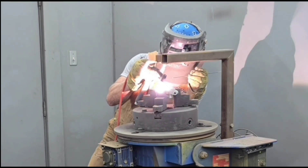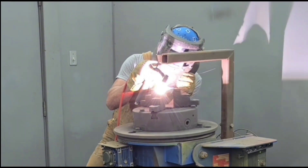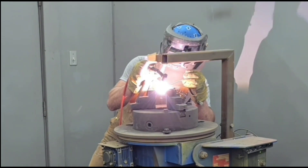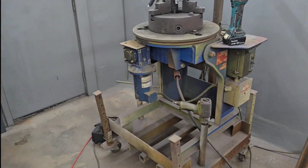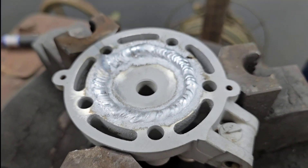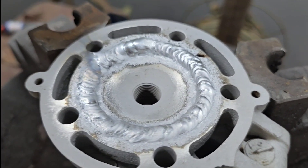The first thing I did was go all the way around one full rotation with the TIG and I didn't form a puddle — I just etched it and cleaned it with the TIG torch, the gas, and a little bit of heat. Then you can see here now I'm adding rod, and I went all the way around that inner combustion chamber and solidified there at that ledge.